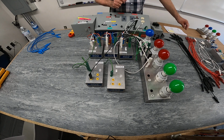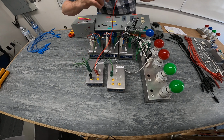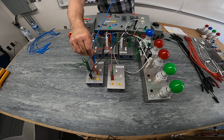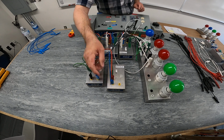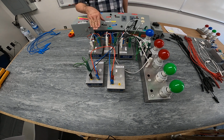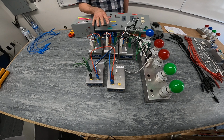Then from there, I'm going to connect the output of my first three-way to my second three-way input. Then other output of first three-way to input of second three-way. So this will represent our travelers here, and actually between our three-way, four-way, three-way switching, the red and the blue wires way back here, when I connected them, they will represent here, for example, our traveler wires. So where you see red and blue, that represents our travelers.